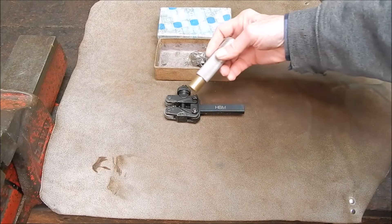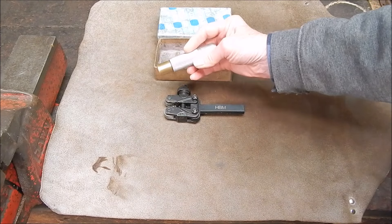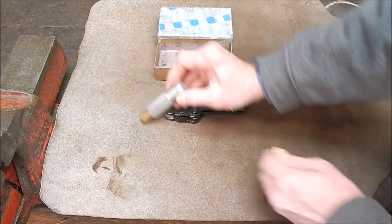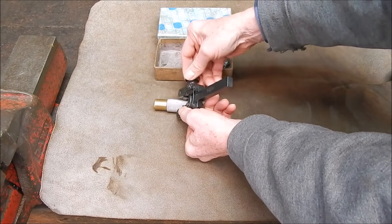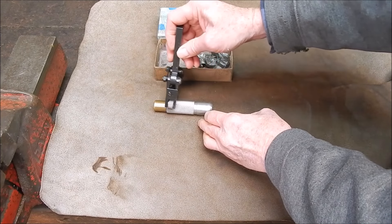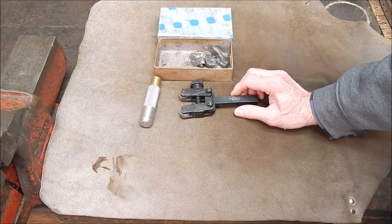Here's something I've done with this — it's a little knocker for tapping work into position on the lathe or whatever. It's like a little hammer. Works well. That was basically just pinched in there like that. You run the lathe, feed it along at your fastest feed rate, and you get a nice, even pattern. Does a good job.